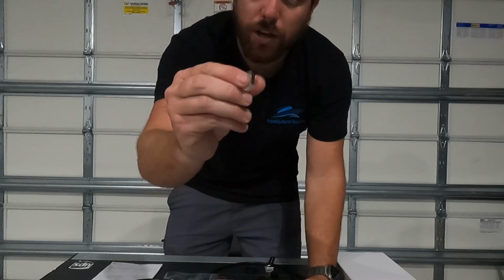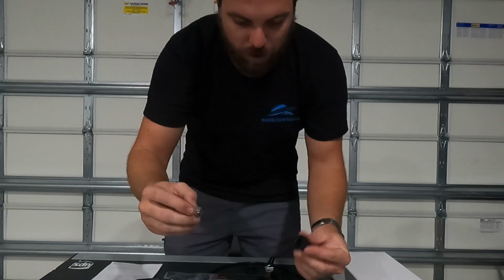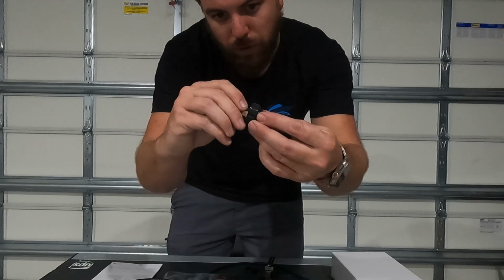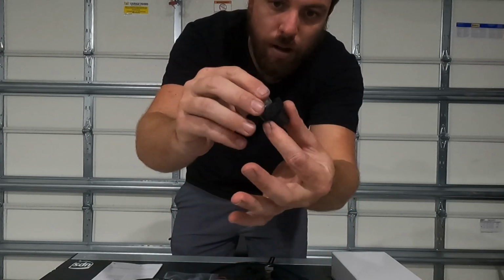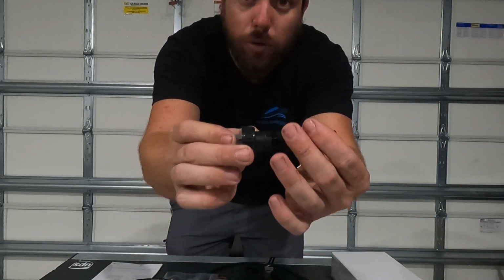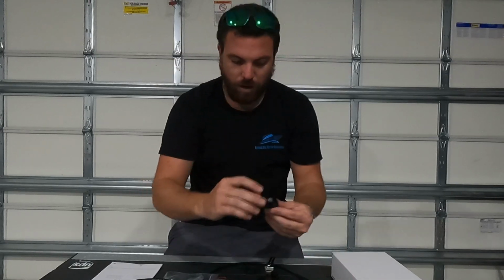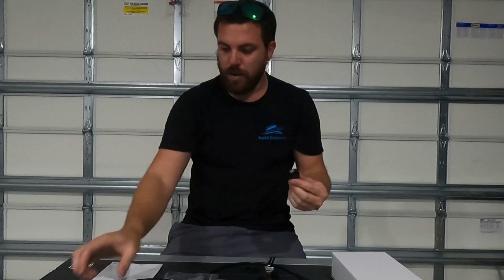You will take your RJ45 connector, you will crimp this onto the end of that, and then you'll push this all the way back, which will put this RJ45 connector into this side here. And then you'll take this last slide piece, bring that up, and compress everything together, which makes a nice watertight connection here. I did forget that you will put your O-ring inside of here.